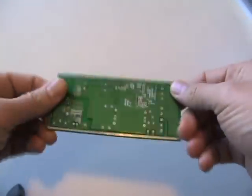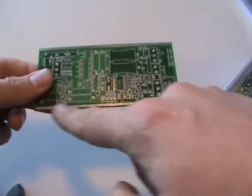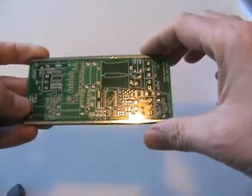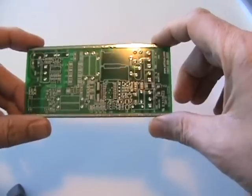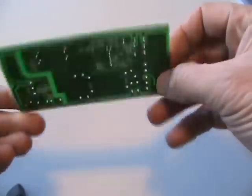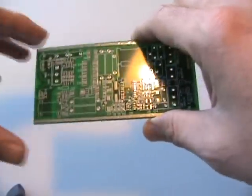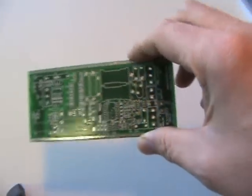We redesigned the board in this way. As you see, there are two copper strips on both sides — top and bottom of the board, plus on both sides of the board. This is the chassis connection, and it helps to reduce EMI, especially for surge input. We also use very good ground coverage all over the area and provide clearance from input to output for voltage isolation, along with many other considerations in the board design.